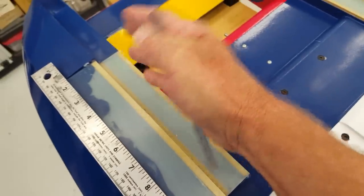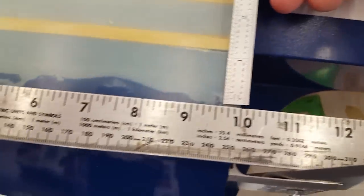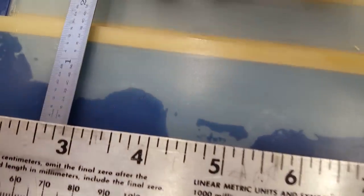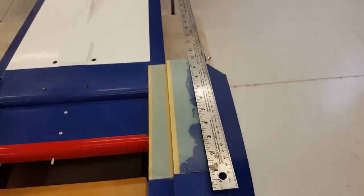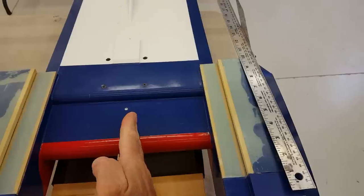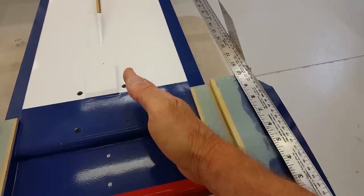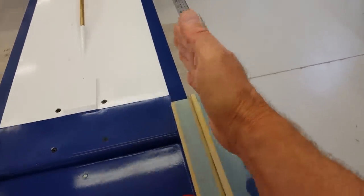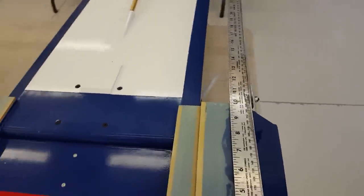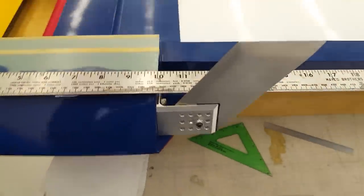Another easy way to check it: if you use straight ride pads, you can simply measure to the edge of the ride pad — it's about an inch and a half there and about an inch and five-eighths here. So I use what I call toe-out — that is where the front of the fin is out away from the center line of the boat, back in slightly, front out slightly. That's a dramatic look at it, but I toed my fin out just a little bit.